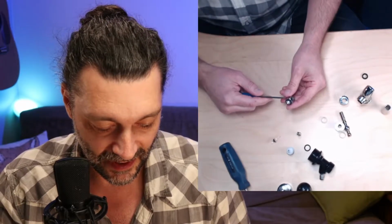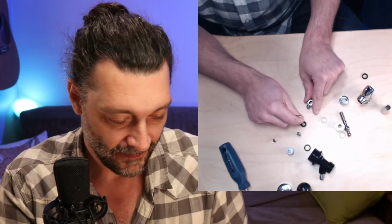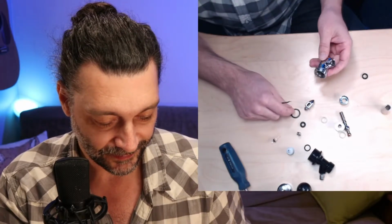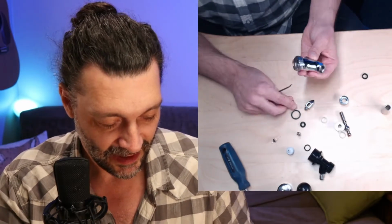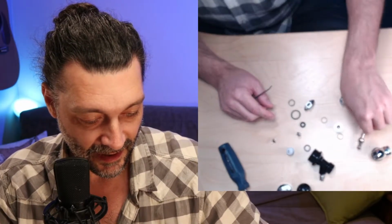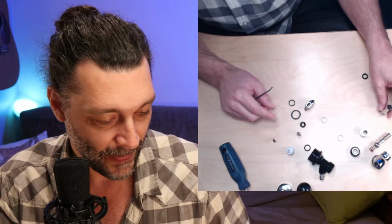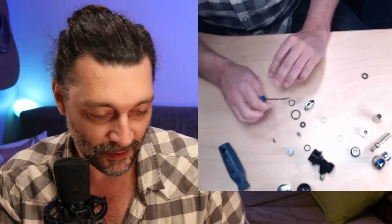And then even with the washers here, you can take that off of there. There's one on that shuttle, and another one hiding in here that goes up against the shank. And there's another one in here that goes up against the spout. Then you're left with a solid hunk of steel. Actually, these are all chrome plated brass. This is steel. The new Nuka taps will be replacing these eventually.